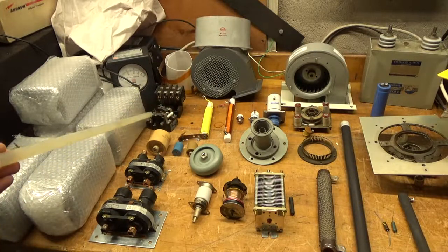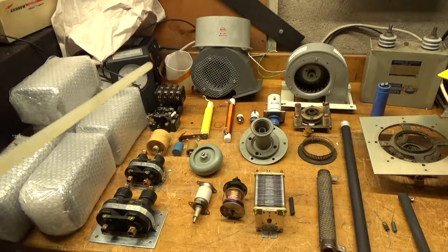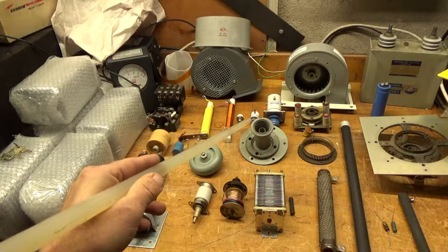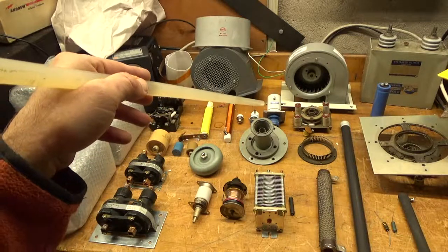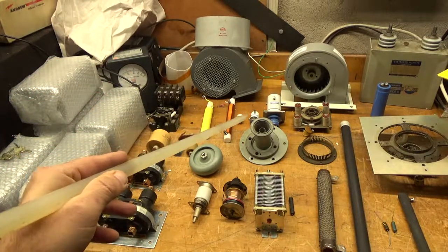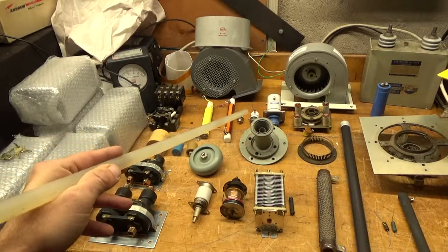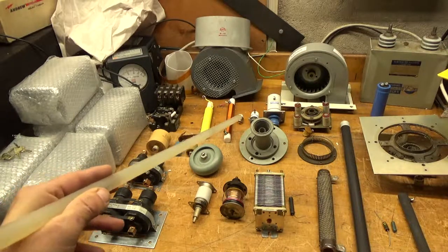I never use relays like this in a large amplifier. Above an 8877, I always use a vacuum relay. Even 8877s like to use vacuum relays. You have different vacuum relay sizes — RF-10B and others. They're rated for different amounts of current, but that current rating is actually at 60 Hz, not at any particular RF frequency. As you go up in frequency, the current rating goes down. It's easy to figure out the amount of current across the relay contact — just use Ohm's law. If the amplifier is seeing a 50-ohm load, just do the math.